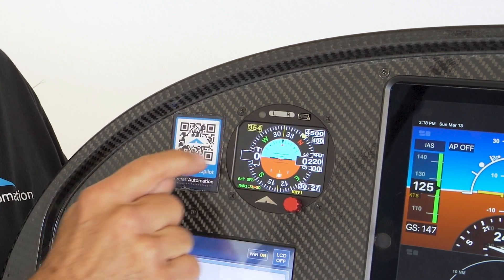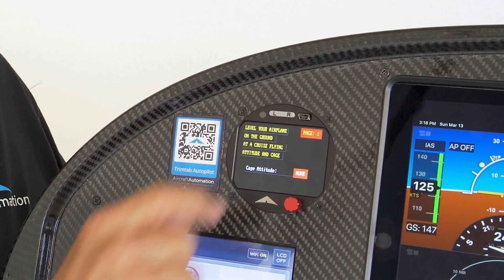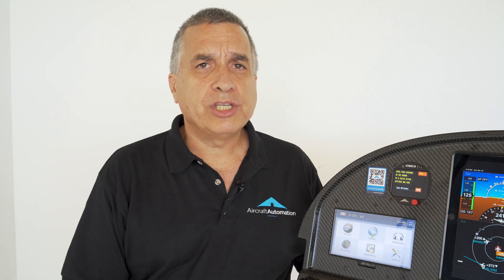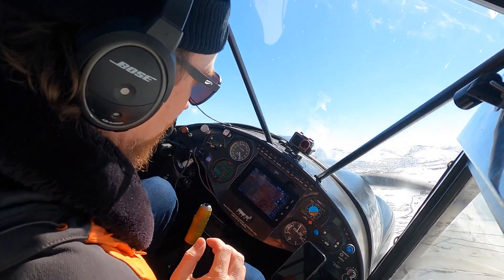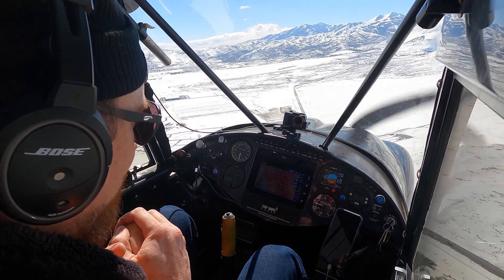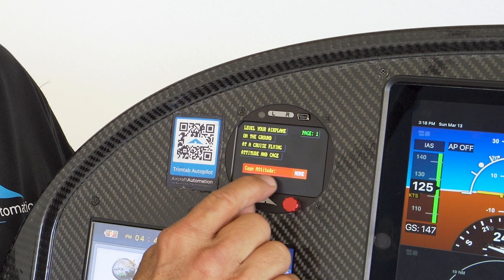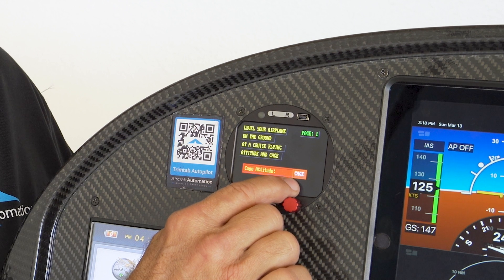We can toggle from L to the initial screen as many times as we want, just like we do with any menu. So we press the L key on page one, we can see the autopilot instrument. The SuperEcho will show that it wants to cage. It's important to cage the artificial horizon so the autopilot can recover from unusual attitudes. Remember, when you press that disconnect push button for three seconds, the SuperEcho autopilot will recover your airplane from an unusual attitude. That's why we need to have it caged for cruise flight. So we click on the knob.